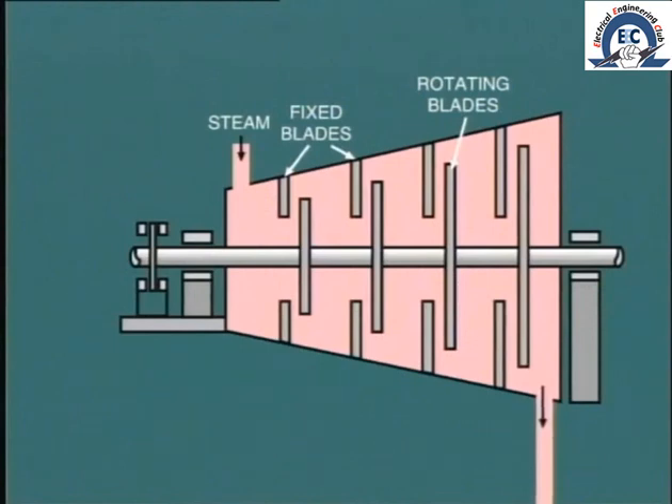Well, in this single cylinder arrangement, the flow of steam through the turbine tends to push the rotor towards the generator. If this thrust was not contained, the rotating blades could conceivably come into contact with the stationary blades of the next stage and cause quite a catastrophe.